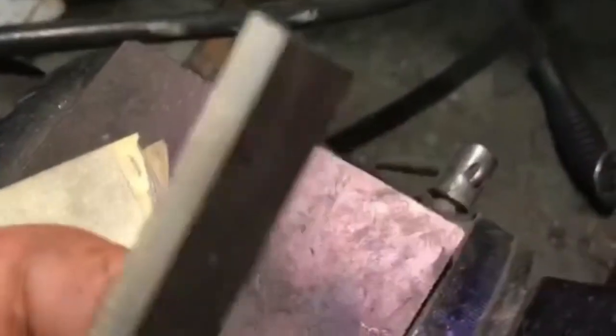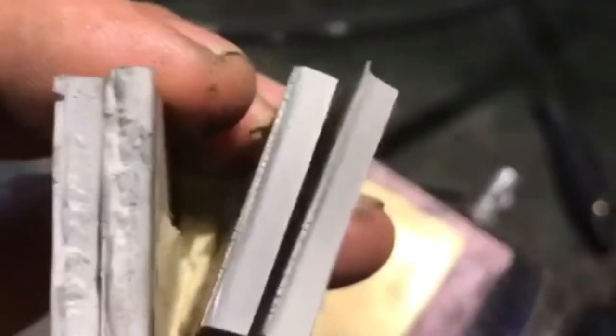The water quench is not as clean but it's better than expected. I'll get a micro shot from these. The air quench — I couldn't break it as easily as expected; it's still soft. Oil is clearly better — you get that really nice grain. Here's a macro shot of the oil grain showing the scales outside and the grain inside. The macro shot from the water shows the grain is not as clean — you can see gaps and deformation.